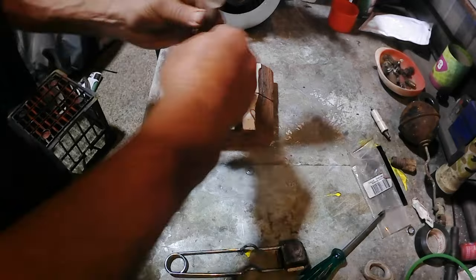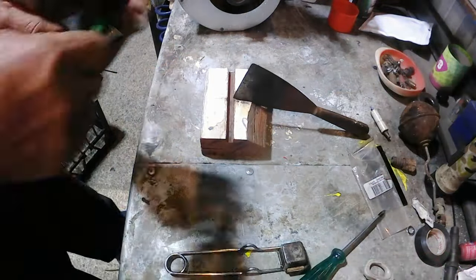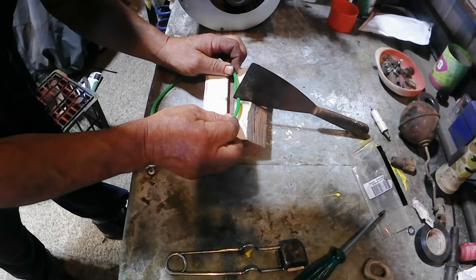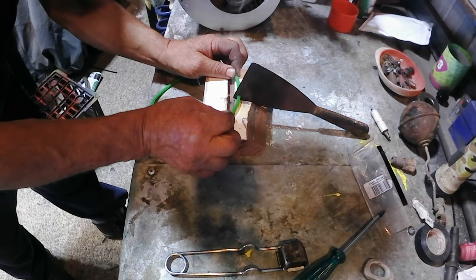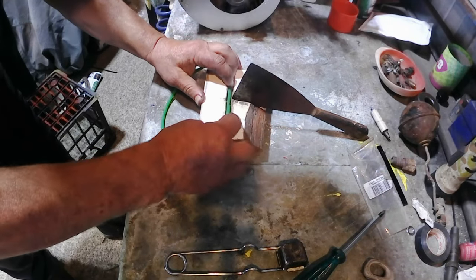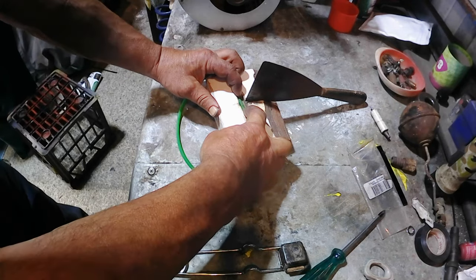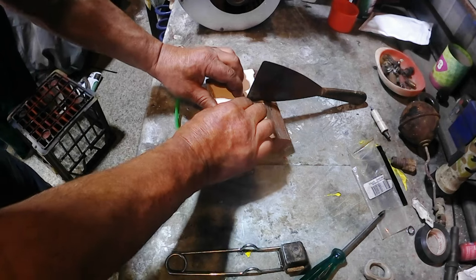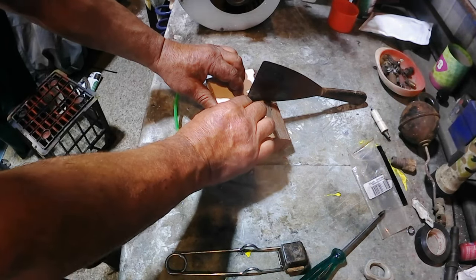Glow red. Okay, now before it cools down too quickly, put it back in the slot. Now we take our bits of PU and we just hold them against it until it starts to melt. Feel it bubbling and melting, and then we slide them in there and push them together using the groove to keep the join straight and flush. So we've just heated up the ends, melted them, and now we're just welding them together.